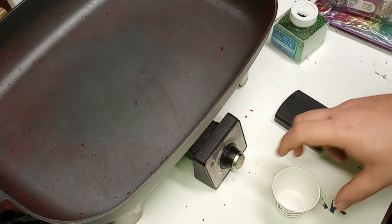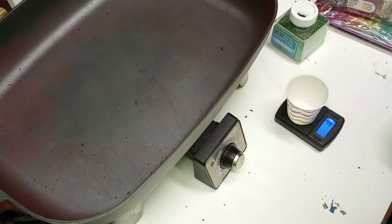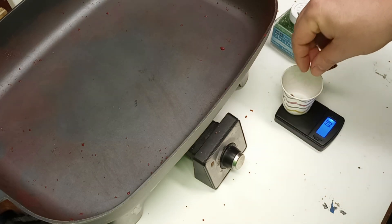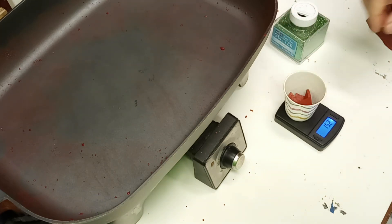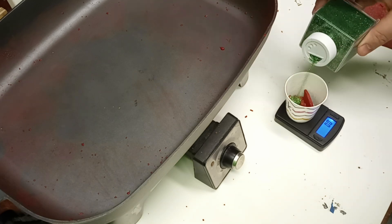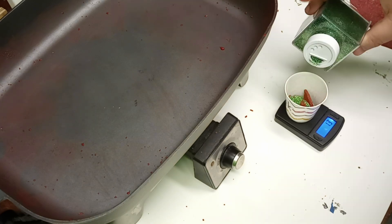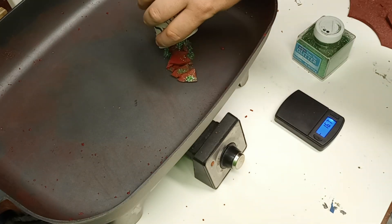With all these, I added about 10% by weight of the additive. That way the experiments were consistent with each other, and that's about the percentage that most people use to generate black smoke in composite motors. I have some propellant already mixed left over from previous motors. So I'm going to weigh out 15 grams of propellant and then add 1.5 grams of glitter, and we're going to melt and mix everything together.